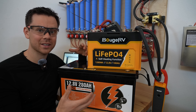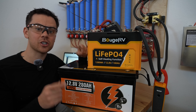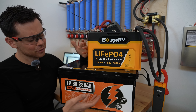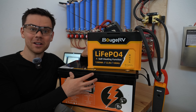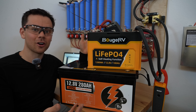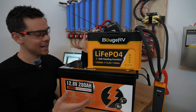This is a common feature on higher quality batteries and has been around for about six years, so there's no excuse that new budget batteries can't program that time delay function to handle surge. EcoWorthy and WattCycle do not have that. WattCycle said this morning they're going to change their overcurrent protection to be much lower and safer, which is great. Especially for solar use, you're not going to hit that surge capacity, but if these are starting batteries, you absolutely need it.